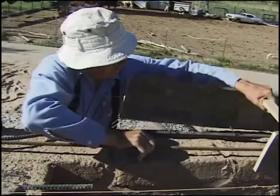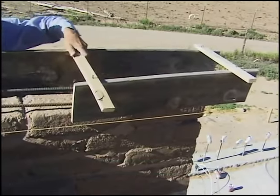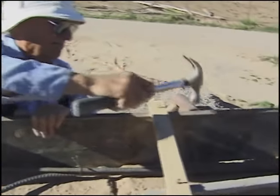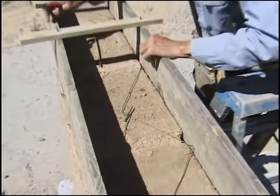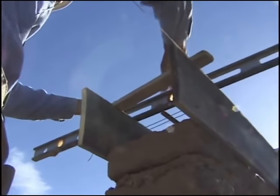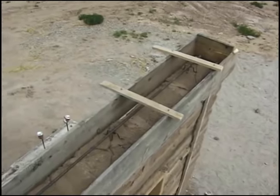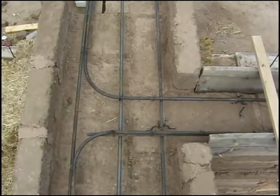On narrower walls, like this standard 10-inch thick adobe wall, we're going to use a more conventional approach to forming up the bond beam, and that is with lumber. Here we're using some scrap lumber, and it's affixed as a kind of pre-assembled piece using a friction fit to keep it from falling off. There are wire ties on the bottom that criss-cross, making a rest for the forms to sit on. Accuracy here is very important — you want everything straight and level, and the pour must be at least six inches thick. Once everything is in place, you can add your number four rebar. Notice that as it comes out of the 10-inch wall into the two-foot-thick wall, it actually crosses over to the far side, which is a technique that makes for a very strong wall.